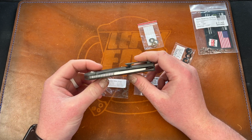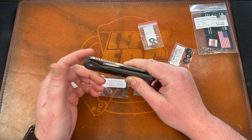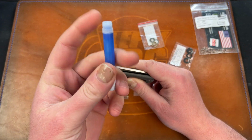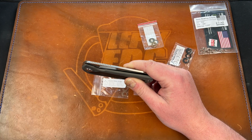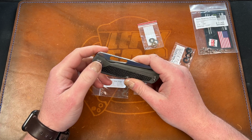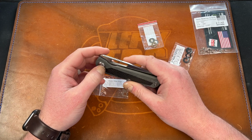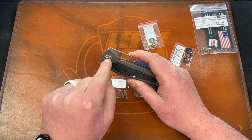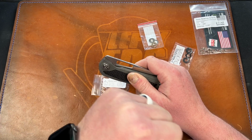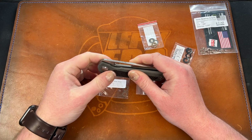So what I did after the live was I took the pivot out. I had to break the Loctite. It was already cured in a couple hours, which is pretty cool. I really love this stuff from Vibratite, the blue. And there was a good amount of Loctite in there. I had put a good amount in, and I'm thinking maybe from previous cleanings there was still Loctite in there. Because if you looked into the pivot at the bottom, there was this whole big blue ring in there. I tried to get in there with a brass rod and crack it and break it, and alcohol, and I got most of it out, but not all of it.